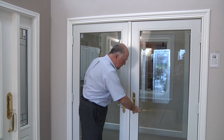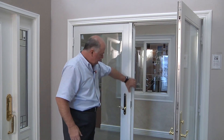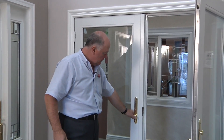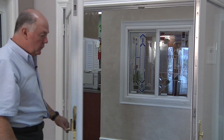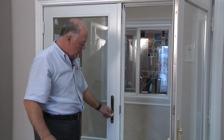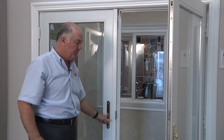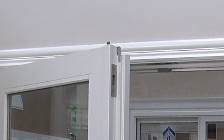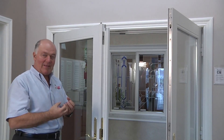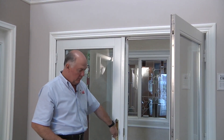To undo: release the deadbolt, pull down on the lever — that retracts the hooks and the latch. On the passive door, which is bolted into place, pull down on the lever to retract the bolt at the bottom and top, allowing the door to open easily. To close it, shut the door, lift up, and the bolt throws into the top and down into the bottom, engaging with a stainless steel plate so the door is locked very securely.